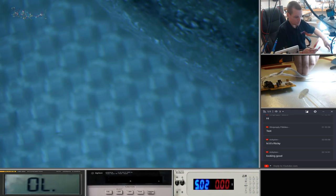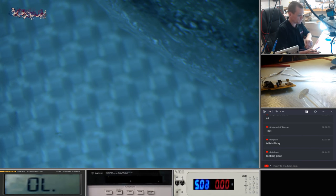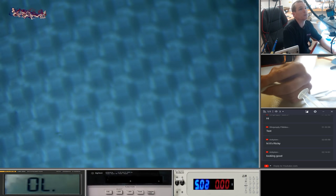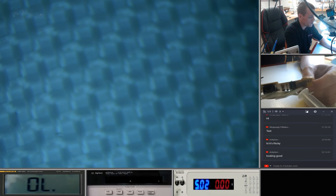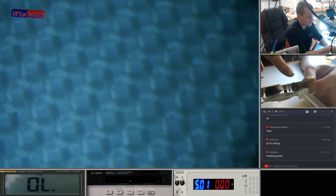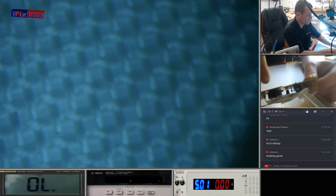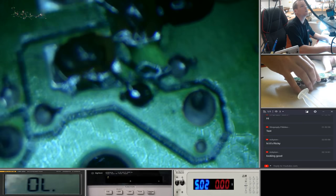It's quite a large keyboard. I'm not going to be able to show you it working. But the initial problem was, the cable had got in there, it'd been yanked up, and that's pulled these two pads, cleaned out the board. So we've taken the pad off, we've run a jumper from there to there because those are both ground from what I can tell. This center pin's the power connection. It's got quite a large pad area here, so let's get this back over here.